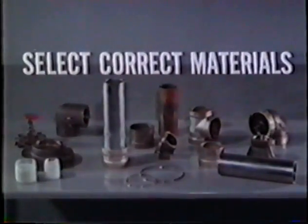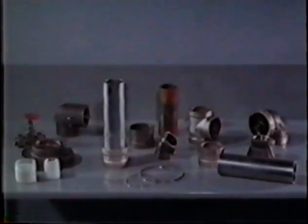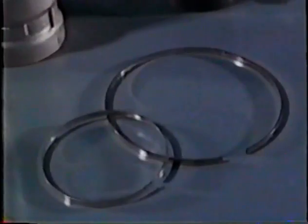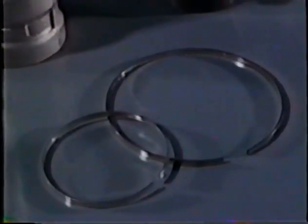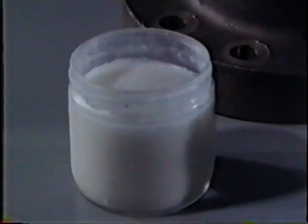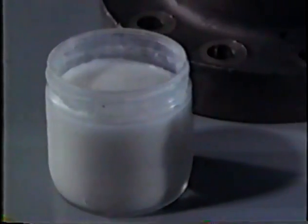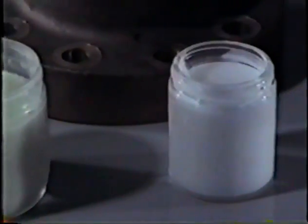There is a wide variety of pipe fittings, brazing alloy, and brazing flux. Learn to identify each type accurately. Pipe and fittings should have identifying data clearly marked on the surface. Dots identify the brazing alloy rings. 3 dots for number 3 alloy, for example. Type B, low-temperature brazing flux, spec OF499, is a satisfactory flux for almost all your brazing jobs. However, use type A for aluminum bronze materials.